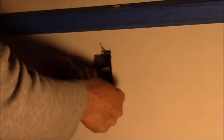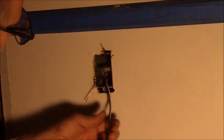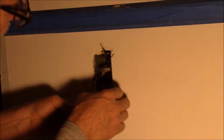All right, so everything neutral goes together. There are no switch legs using the neutral, so I gotta take this guy off. All the neutrals are white. Most of the time the whites will be white, but there's times when you can use a two-wire conductor to go up to a light and back with what's called a switch leg. And in those times, the white wire is the hot one. So you gotta be thinking about what you got.